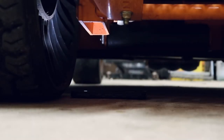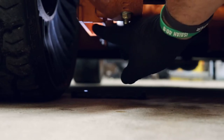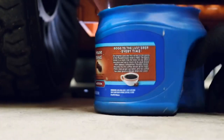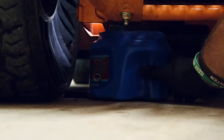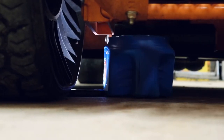First step — right at the front edge of this bracket, this square piece is where the tube comes down for the oil drain. This is why I take a Maxwell House coffee container, cut the top off, and slide it right underneath there so you can drain the oil right into it underneath the back of the machine.